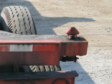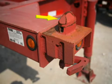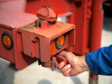There are two basic types of twist locks used on 20-foot chassis: the drop-in type and the cantilever type with a twist lock housing. The twist lock consists of the twist pin, a handle, and a latch. These twist locks mate and lock down with the corner castings positioned at each corner of the container. A one-quarter rotation of the twist lock pin secures the container to the chassis.